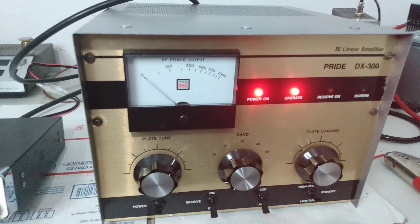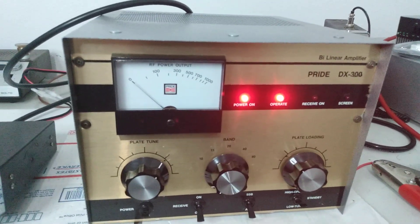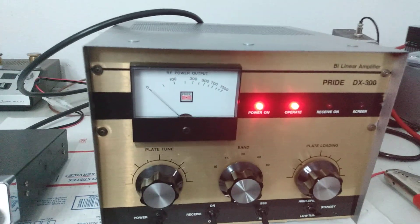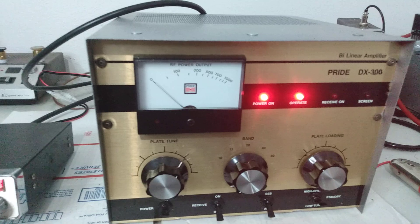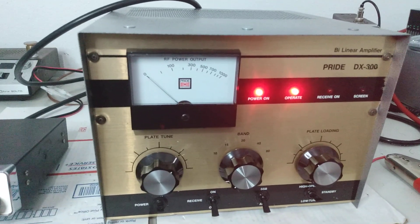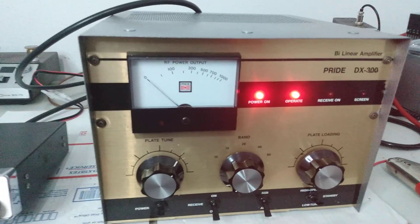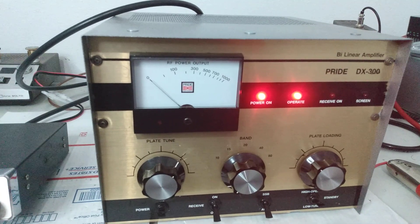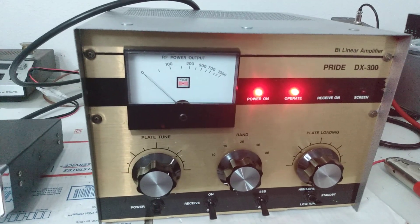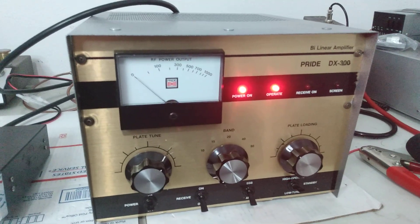It's got a 4CX400 tube in it, upgraded from the stock 4CX250B that comes in them. So you're going to see a little bit more output out of it. These things are very drive specific — it runs a tetrode, which is a low drive tube, and they will blow if you overdrive them. They are tough as nails, tough as any tube out there, but if you overdrive them they will give up the ghost. This one is set up for nine to ten watts average and about 35 to 40 watts PEP, with the main focus being on the average power you put into it. If you put 12 watts into this thing, it's probably going to give it up eventually — it will not take being overdriven.